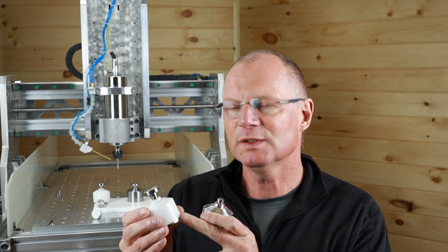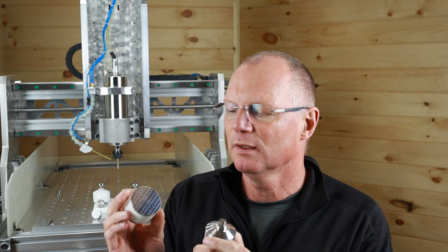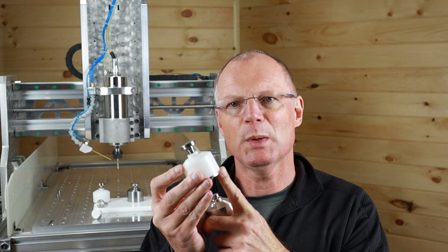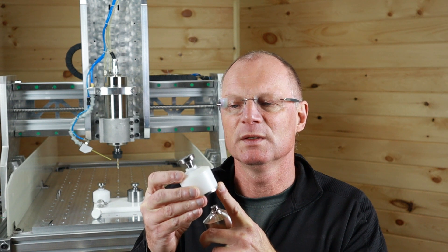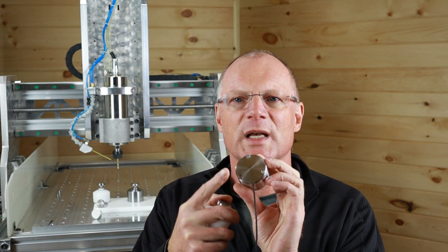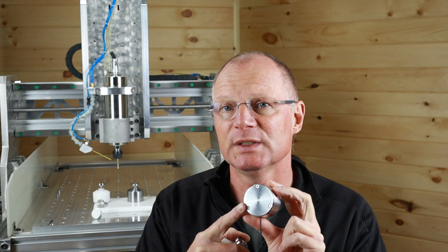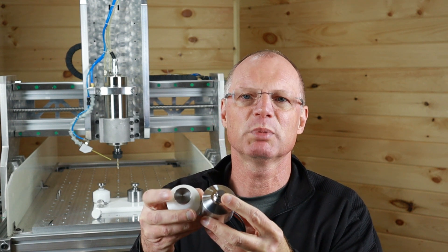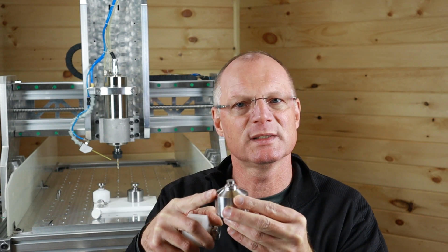There are a couple of things I learned building and using these. One is that the bottom needs to be made from steel. This prototype has an aluminum bottom, and what happened is that it catches dings and nicks just floating around your shop — and ultimately that ding will tilt the probe and tilt the touch plate, which will make a difference in your readings. So the final version has an aluminum housing but a stainless steel bottom that doesn't scratch as easily. The other change is that the diameter of the tool sensing plate is much smaller, so you are forced to go to the center of the probe and the tilting is not amplified.